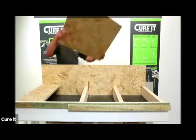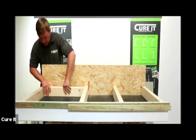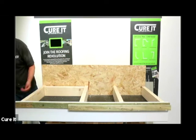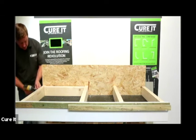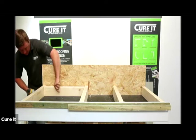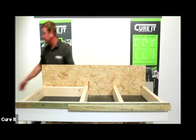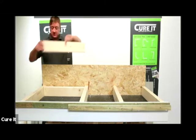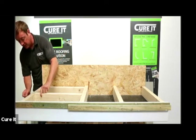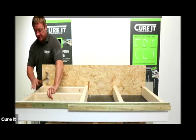To do that with existing joints, you're going to just nog them out using timbers - put noggins in between, spaced no more than 600mm centres. The easiest way once you've cut them is just to screw them in or use your nail gun, and fire the fixings in to hold these noggins in place. This will then give us a nice secure finish. New boards can be nailed as well using ring shanks or nail guns, which will save a lot of time. Position your joints with your noggins no more than 600mm centres.